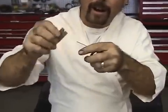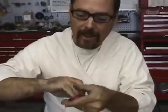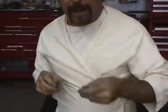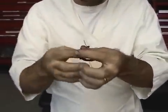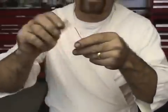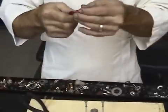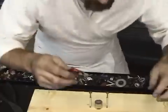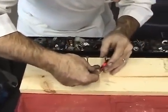Now, if you've got a razor blade, what you're going to want to do is scrape off all that insulation. Watch your finger — you don't want to cut it off like I did in a video. Get all that insulation off of there. On the other side, take it all off except for one side — leave one side insulated. There's a reason for that: it'll shut the circuit on and off, on and off. Actually, I think you could probably scrape it all off since we're working with a monopolar magnet. Then you're going to slide that coil right in there like that and right in there like that.